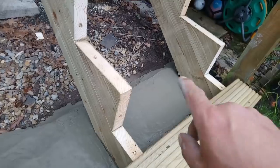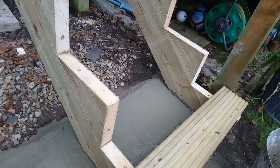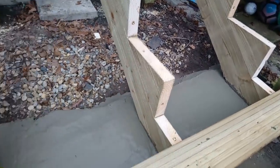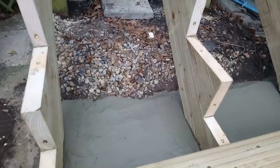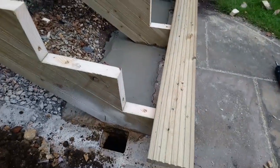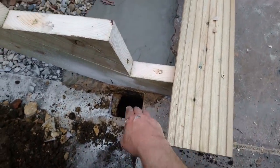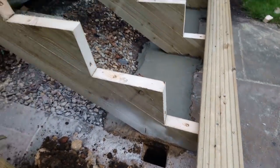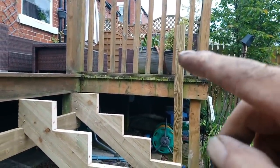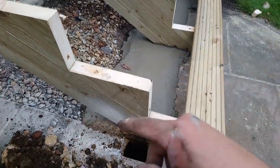I've concreted that — it's a good two inches down there, about an inch and a half here. I've sloped it forward a little bit and it's just to the base. It'll support it — whether it'll help it rot or not I don't know, I'll put plenty of treatment underneath. I nearly forgot about these new posts — I was just going to bolt it onto the side in the end, but no, I decided I'd dig a hole. That's a good eight to nine inches deep. Once it's bolted to this it'll be all right. That's one post cut in half — I'll get that one in and get a bit of cement around it.